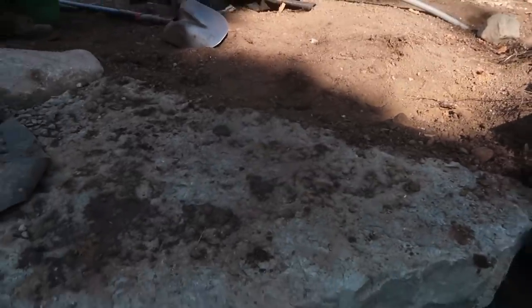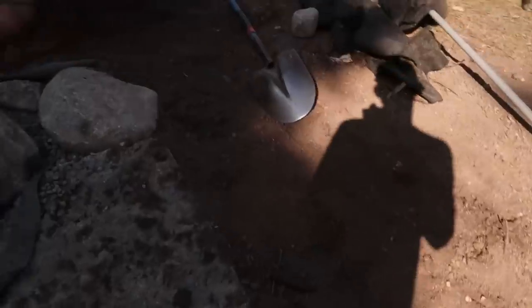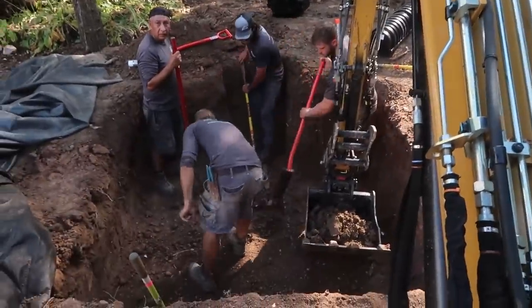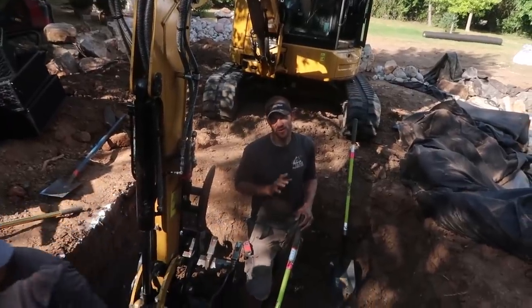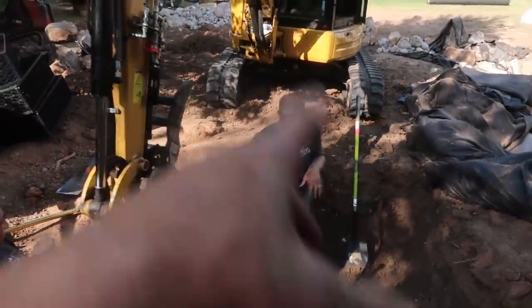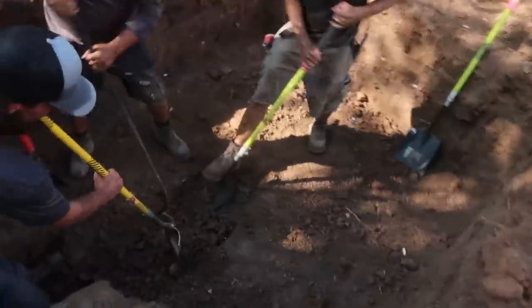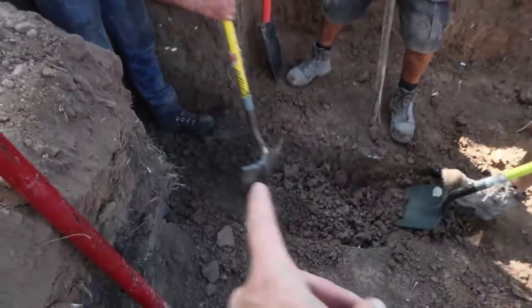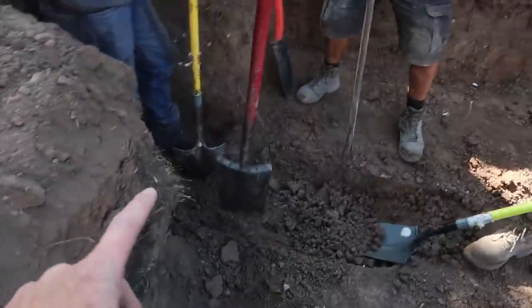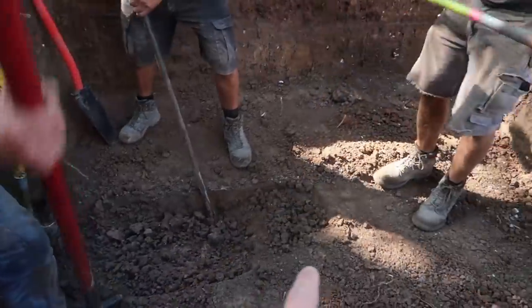This is the final product — here's the step and there's the dirt. You can't tell there's any liner there; we just need to bring the dirt up a little higher and we're good. The hole for the aqua blocks for the wetland has been excavated — three feet deep. Now you can see them excavating for the snorkel, which will go down at the bottom with the centipede. Right where Garrett is standing is where the snorkel goes, and the centipede will lay along the trench Dan is digging out right now.